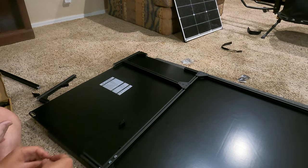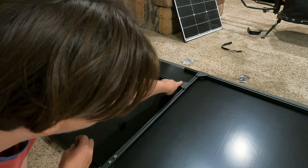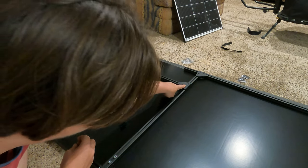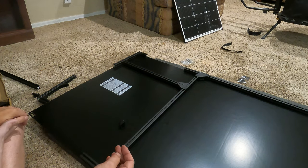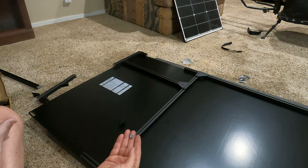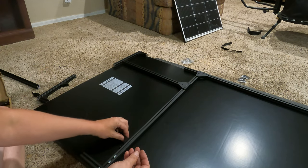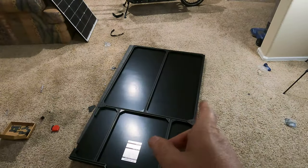I didn't like the plates — they were scratching the trailer so I took those off. I also replaced the corner bracket that was using those cracking T-nuts, swapping in a T-connector with good T-nuts and adding an additional corner brace to make it stronger.